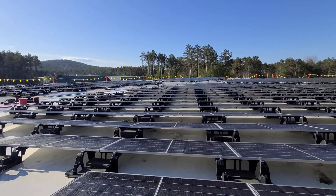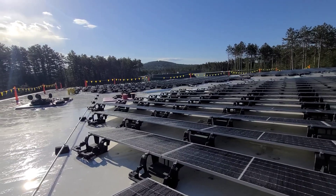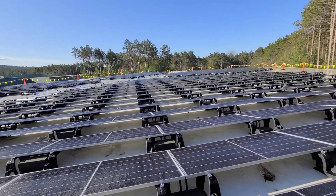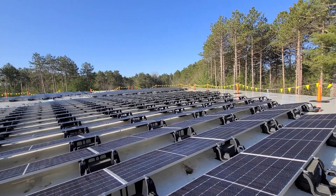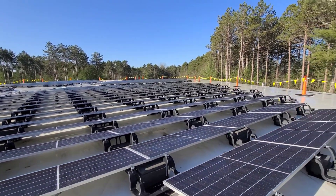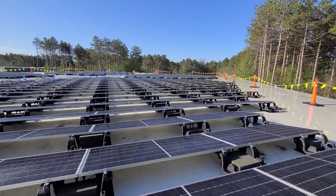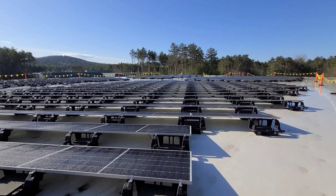It's 220 kilowatts DC and we're maxing out the 150% DC to AC ratio with the SolarEdge. We're doing 150 kW AC, and that's because there are power company requirements when you get over that size for commercial projects.